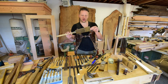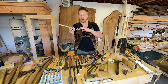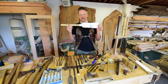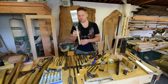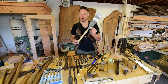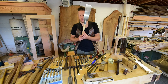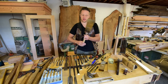The weak points of the machine-made saw: I'm not a hundred percent sure they use the same process of thinning the blade, but the blade is still precision made — all the teeth are set within super fine tolerances and sharpened to perfection, so this is still a precise, sharp cutting machine. The only real weakness is where the blade connects to the handle. Because this is a mass-produced saw made for everyone from homeowners to craftsmen, they've used generic connection methods instead of the long tang that sits deep into the handle.